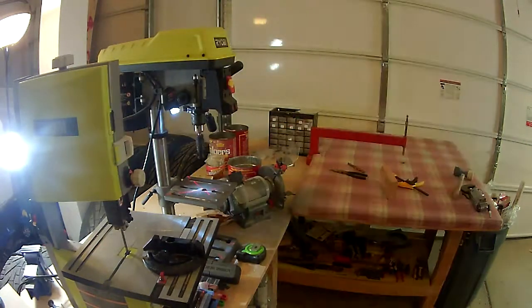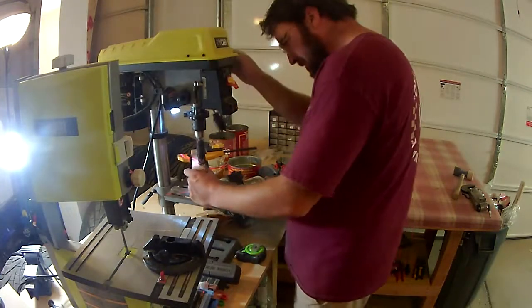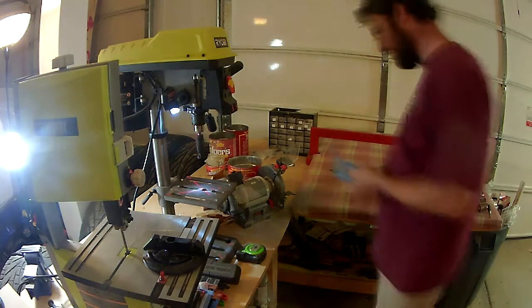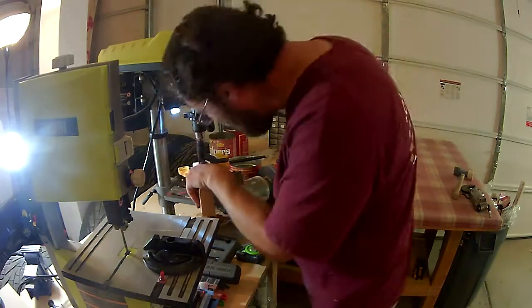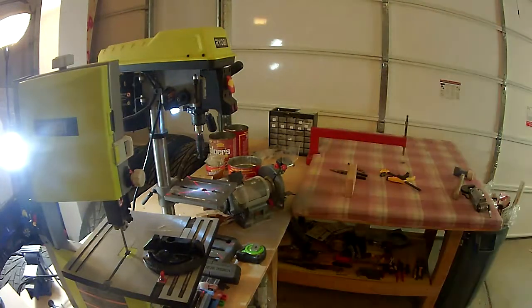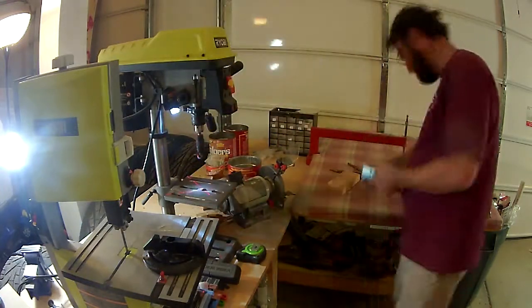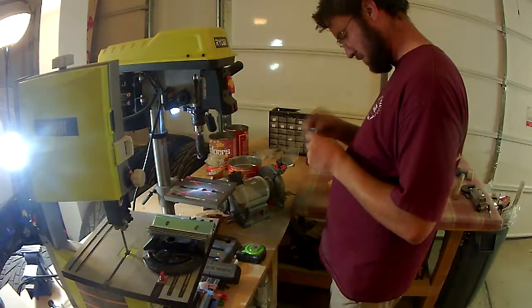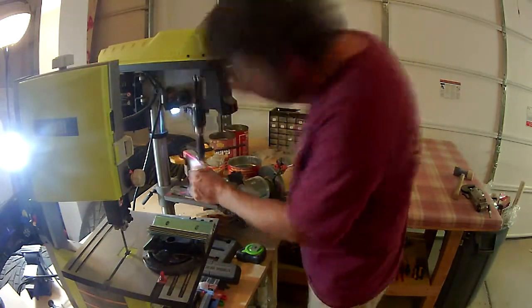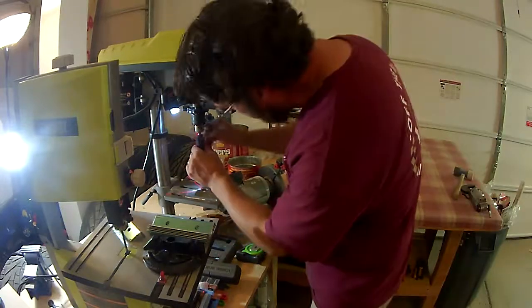There's a lot of prep work — a lot of pieces that you cut and kind of mold together, and it takes quite a bit of work to get through the various pieces you prepare. I just assembled the left fuel tank, did a dry fit to make sure everything works, and then used painter's tape to mask out the locations of all the ribs. I'm at the point where I have to scuff the skins and the mating surface on the ribs to get ready for putting in pro seal. I'm probably about 10 hours into the left tank with all the prep work.